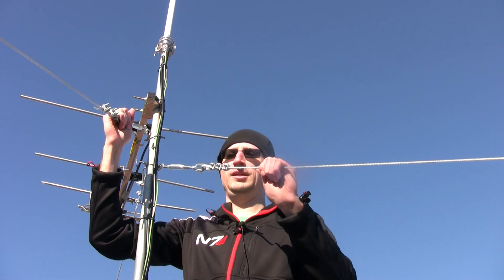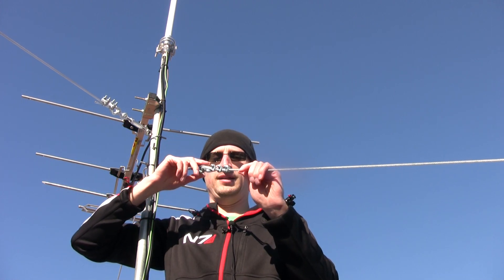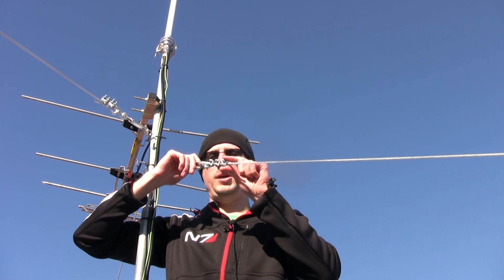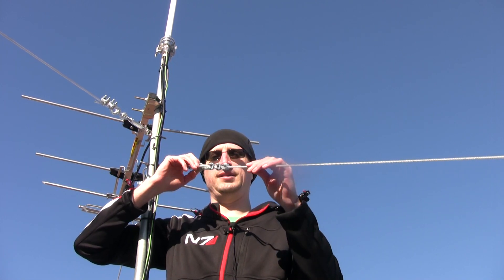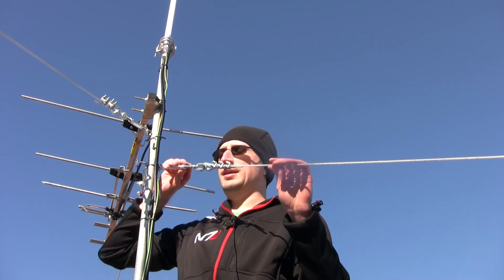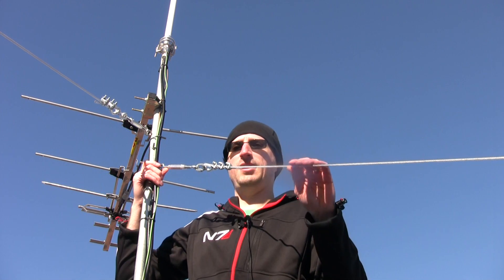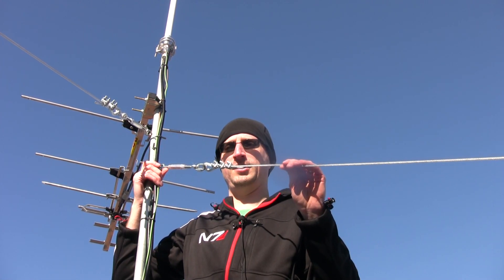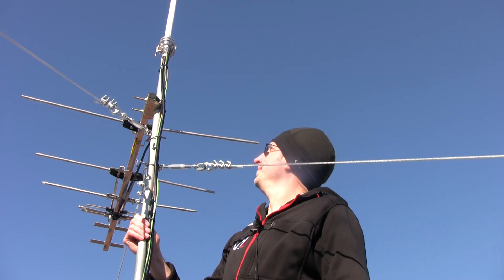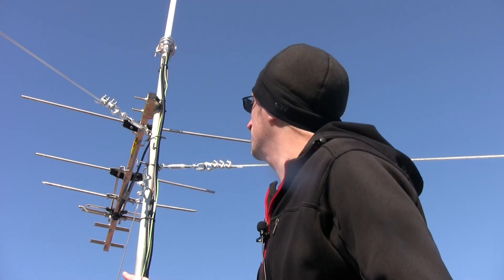There's a really good video on YouTube about mast cabling — the phrase is 'never saddle a dead horse,' referring to which way you put the cable saddle clamps so the nuts are on the opposite side of where the wire ends. As time goes by I can tighten them if it's not level or the cables are slacking out. I've done that from all three directions and it works so far.